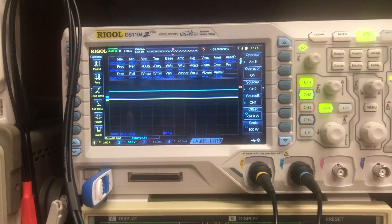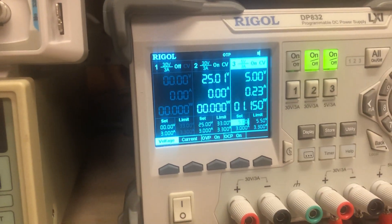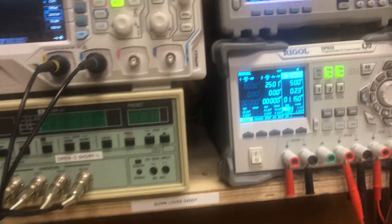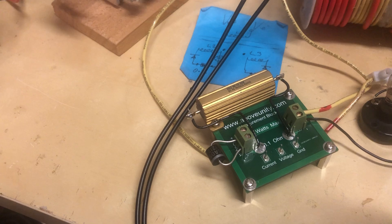I've checked the calibration on this with my power supply against my meter. Right now I've got 25.01 volts on the scope and my meter says 24.99 volts. I've changed the measurement blocks based on advice - I think it's a good idea.